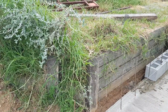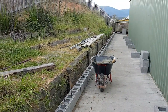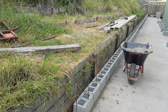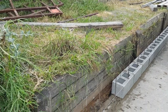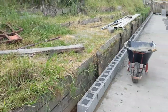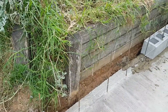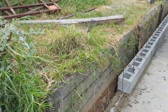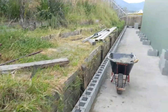Now with retaining walls, there are some basics to understand. Land is not solid — think of it as a very stubborn liquid. It flows down slowly with gravity, a bit like a glacier, but it's near impossible to push back up again. This being decomposed granite, the next stage along is more or less a clay. As it fills up with water it expands; as it dries out it shrinks, giving it the ability to force things apart. The timber posts held up really beautifully for eight years, but they certainly won't last 800 years.